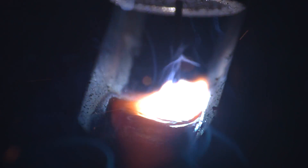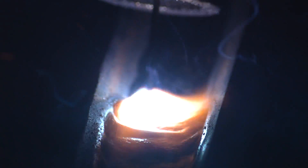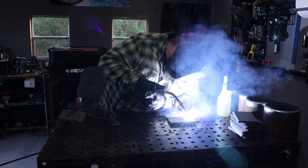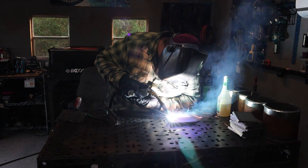We did a second pass here, generically called a hot pass — which is probably an improper term given the nature of what we do, but that's how it's referred to. With this pass I also went side to side, kind of like the root but slightly wider, and this is as wide as I ever take a stringer. I never go wider than this, but I wanted it flat and tied into the walls properly. After this, I'm going to just stringer it — I'm going to run two more fills and two for the cap. We'll see you when we're done.